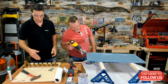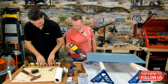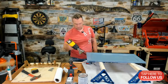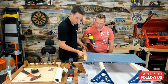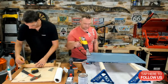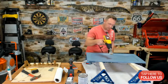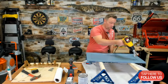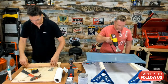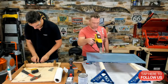This all has to be back like this. Why not use a scrap piece that we had over there? Let's see — yeah, that's almost exactly the width of the door. Let's cut that on the saw, slide it right in between. Now I put this in to mimic the door, and I arrange my pieces as needed.